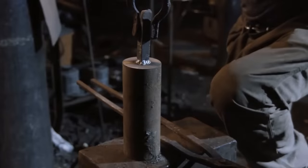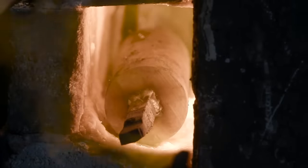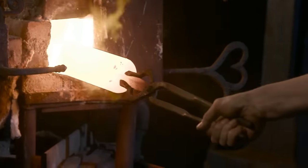To make all the bladed portions of the axe, I'm going to use tool steel 1045 that comes in round stock. I will first form the main blade of the axe and then take the same tool steel and make the 2 spearheads, which will turn into the spikes at the top and at the side.